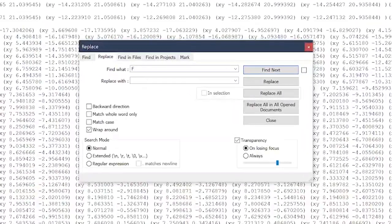Be sure not to delete any of the polygon information or the header at the top of the file. We need to delete both of those elements in all three of the files we created. Of course, save the files after you've modified them. The last bit of cleanup is to open up the front copper file and do a search for f.silks — which is the front silkscreen — and replace it with f.cu, which is front copper. Once you've replaced all instances of f.silks with f.cu, save the file and we're done modifying them.